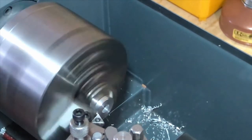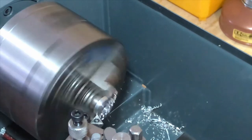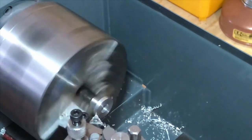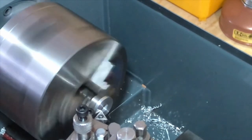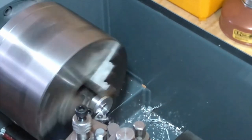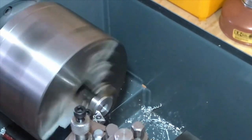I took a little bit of an aggressive cut there — that's okay, just back her off a little and start again. I cut the flange a little extra thick because sometimes you don't get the best cut with a hacksaw, so you end up having to turn it down more than you normally would. I'm struggling with this mini lathe parting — I've tried the upside-down method and the standard method, and I've got about three different parting tools, but none of them are fantastic. I'm sure I'll sort it out.